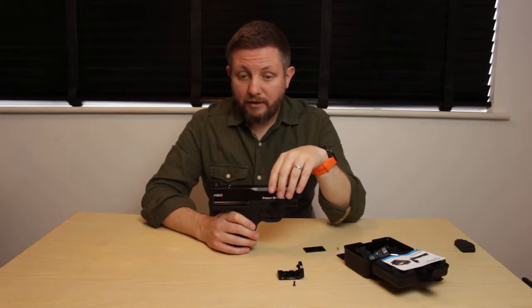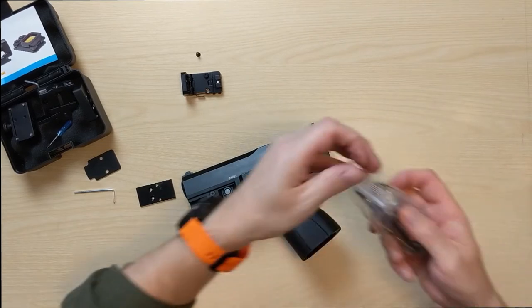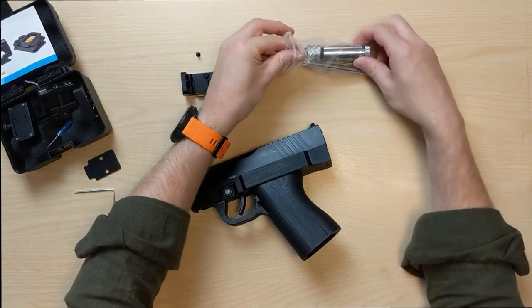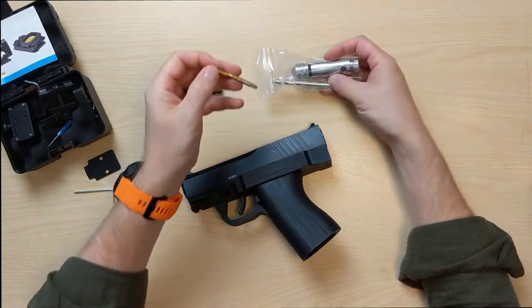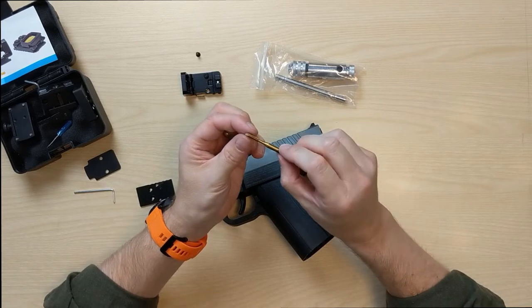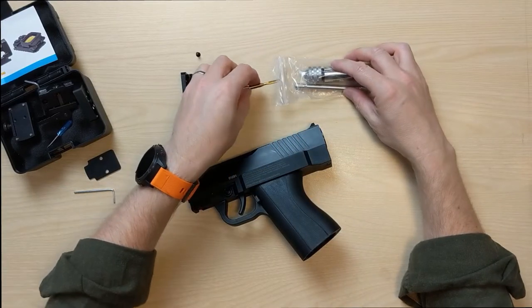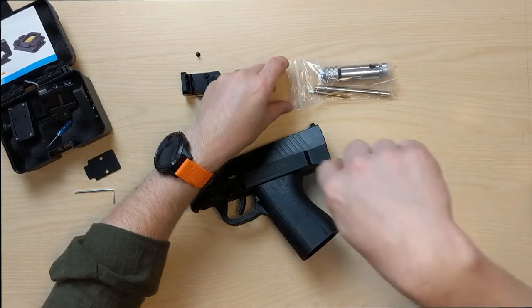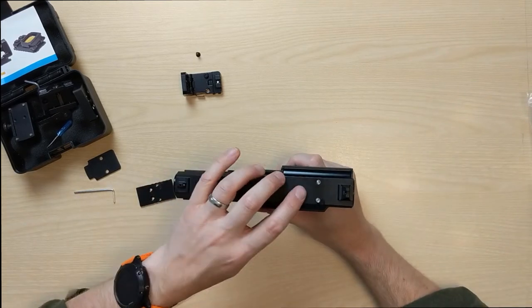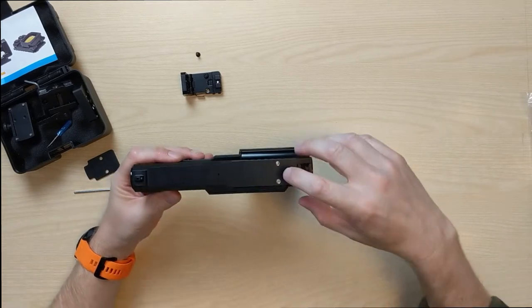You then use the tapping tool. It is kicking around here somewhere. Right, here's the tap. That is the actual one that I used for this particular job. You put it into this device like a drill bit, and as you screw into the hole, it cuts the thread for the screw hole. You do have to be pretty careful not to sit it in the top and just thread the top of the hole so there's no bite. But with a bit of pressure, it bit quite easily. I didn't have any problems with it.